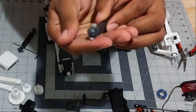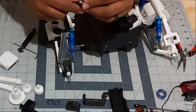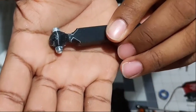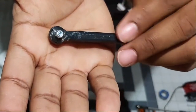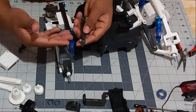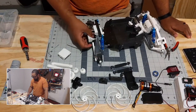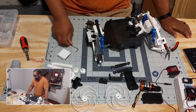The dog bones are the hardest pieces to print — you can see how they have a lot of residue on them. They move a lot, so when this thing is driving forward they turn inside there, and there's a lot of plastic-on-plastic contact that causes a lot of friction. These definitely need to be as curved as physically possible, but if you look at them closely they're not all that great curves — because it's really hard to get these types of curves in a 3D printer. You either put in a ton of supports or you let the printer just do whatever it's going to do.